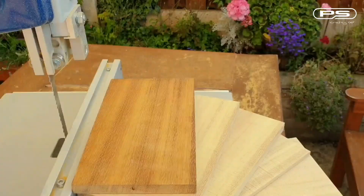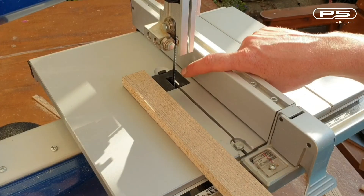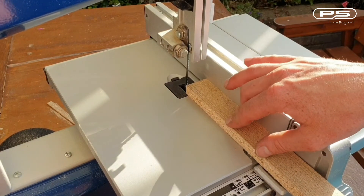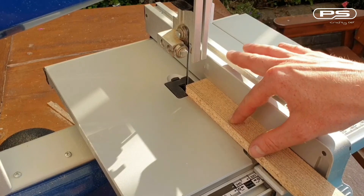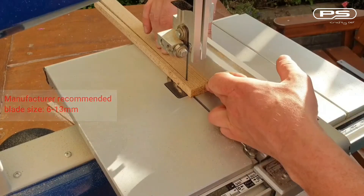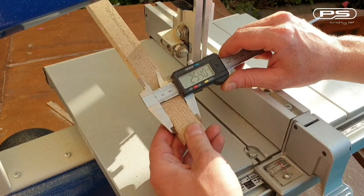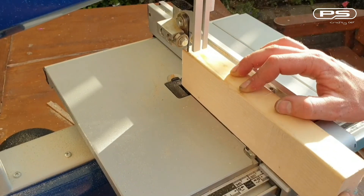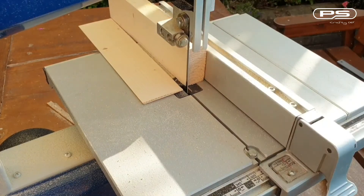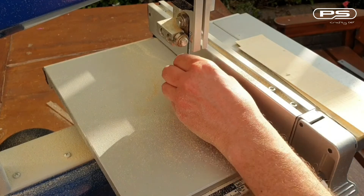You can't compare a 1/2-inch blade with a 3/8-inch on a straight cut, of course not. So I've set up the saw with a much smaller blade — this is a 3/16-inch 6 TPI blade, and it's actually slightly smaller than what the manufacturer recommends running in this saw. Measurements came in at 25.34mm and 25.38mm — and with the thicker stock it will still cut straight. There is plenty of support from the bearings to run a blade even this thin.